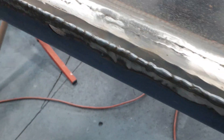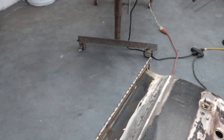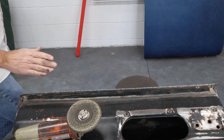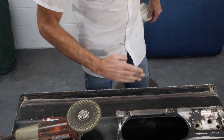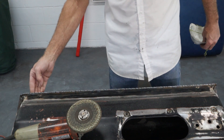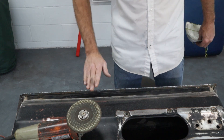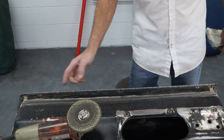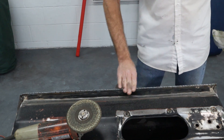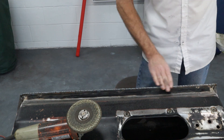We're going to go ahead and get this ground. I've got three spot welds I want to put in — I already drilled the holes for them — but I want to get it ground and all done, then we'll get the spot welds in and see how it came out. We're going to start by grinding straight up on both sides. I ran a super tight bead on here — barely any sticking over the edge, which is nice. But there are little blobs here and there. I'm going to grind very carefully along the face here and along this face, then dress the top. I'm going to clamp a straight edge on here so I have something to grind to, to keep this nice and straight. There's some up and down from the weld bead, so we want to make sure we get a nice, clean, straight line.